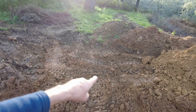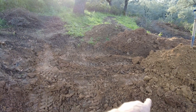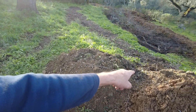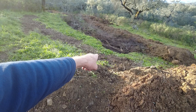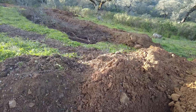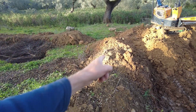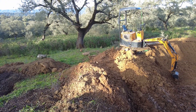The spillway will be here, about two meters wide, and then the overflow through the spillway will go to the next swale. I also have lots of topsoil that was scraped off before — that must just be placed on top of the soil over there.